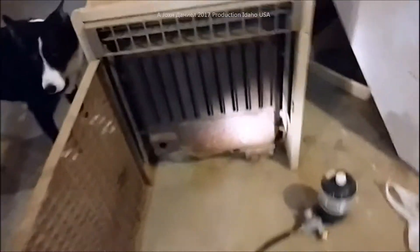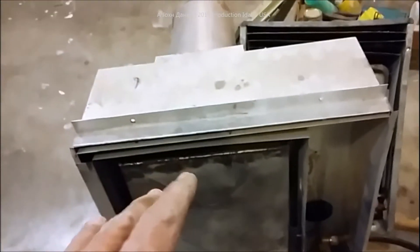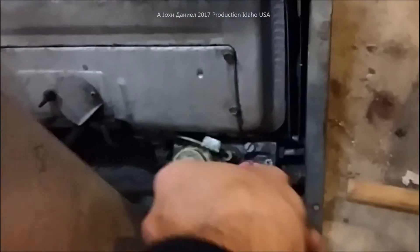Over here I have another one that's just recently been fixed - I rebuilt the valve inside of it and it's currently on and working, as you can see up inside there. This one is from a 1963 Shasta; it's a Duotherm. The heat chambers are very durable - the flame doesn't actually hit the chamber; they have some diverting metal inside to concentrate the heat, some baffling.